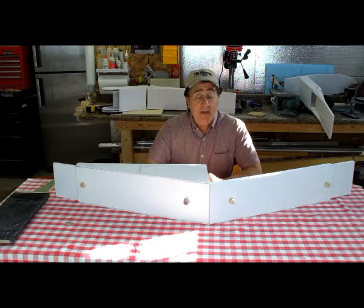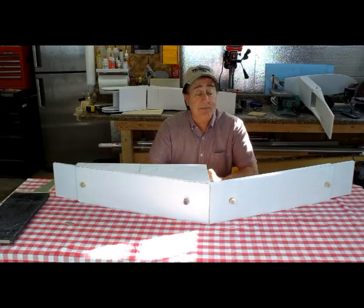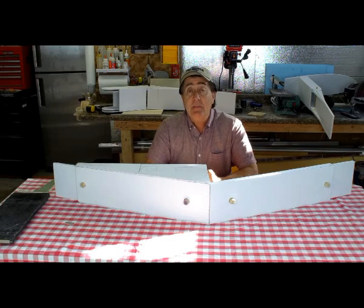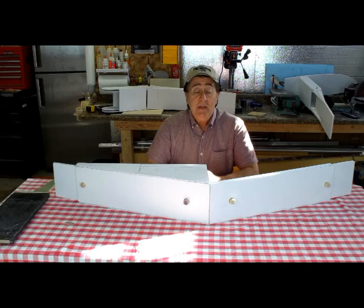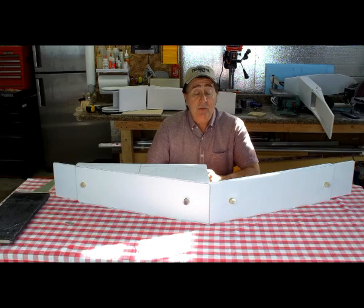What you see in front of me is one of my high-tech 3D models of the wing attachment system. I don't do any 3D modeling in computer programs — it'd be a steep learning curve, and for the most part they're a wasted effort because most people are not going to build to the tolerances that 3D modeling creates. 2D drawings can be done quicker and easier, either by hand or in a standard 2D CAD package.